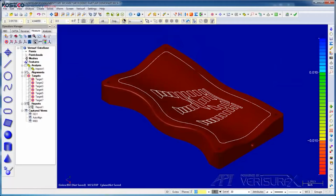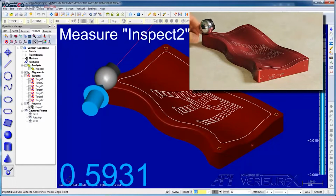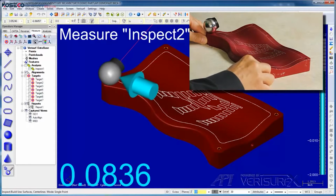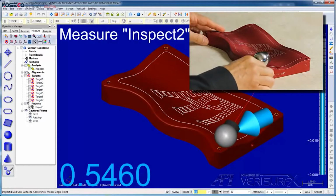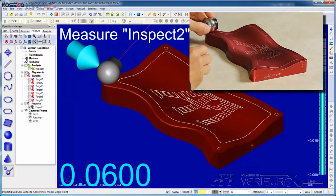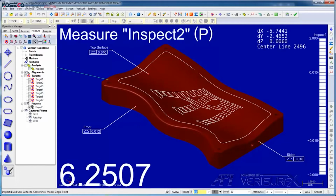I'll select and build to circles first because that's a quick way of getting the part close. I'll place the SMR into one of the holes and move the part in the direction of the arrow. This is just to get it close, so I won't bother using a pin nest. I'll then move to a second hole, repeat the process, and try not to move the first hole. When I'm close, I'll cancel the selection, display MBD, and build to surfaces to get it closer.